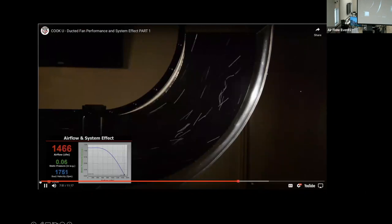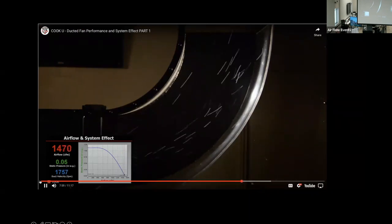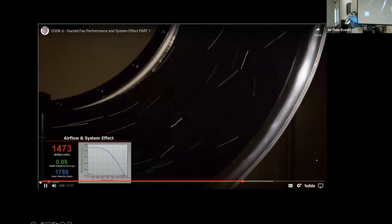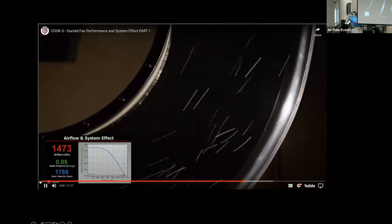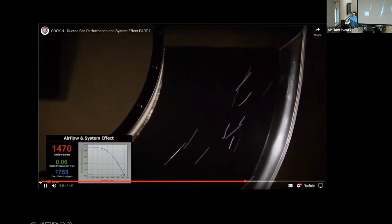So why not use a long radius elbow everywhere? Sometimes there is simply not enough space. This fitting takes up to 68% more real estate than the other elbows we have seen. It also costs somewhat more. From an energy use standard, it is the ideal, but the space required may be prohibitive.